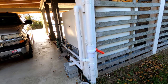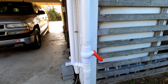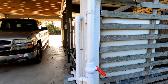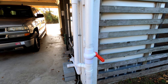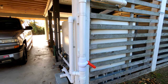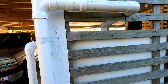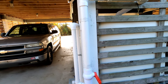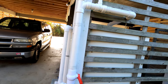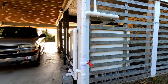After a rainstorm, I come out and open the valve to flush out any nasty water collected in the first flush system, then simply close it again for the next storm. I do question whether I really need the first flush system now that I have gutter guards and a good filtering scheme at the tote. But since I want the valve there for winterization — to let water flow through and not into the totes — it works pretty well. I feel this inline first flush system looks nicer than having multiple separate PVC sections.